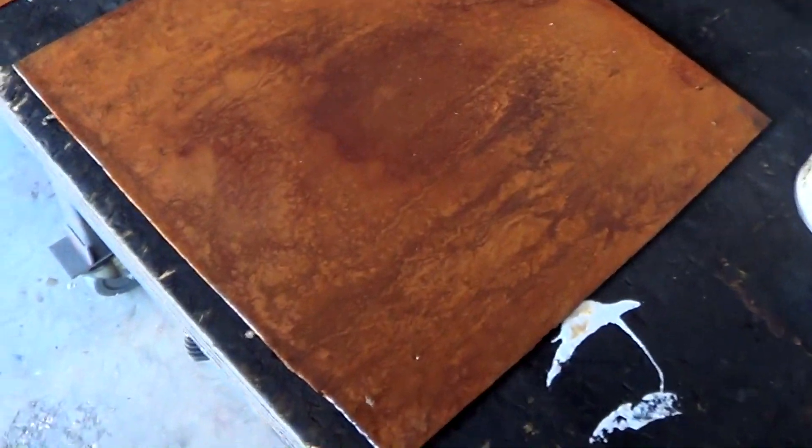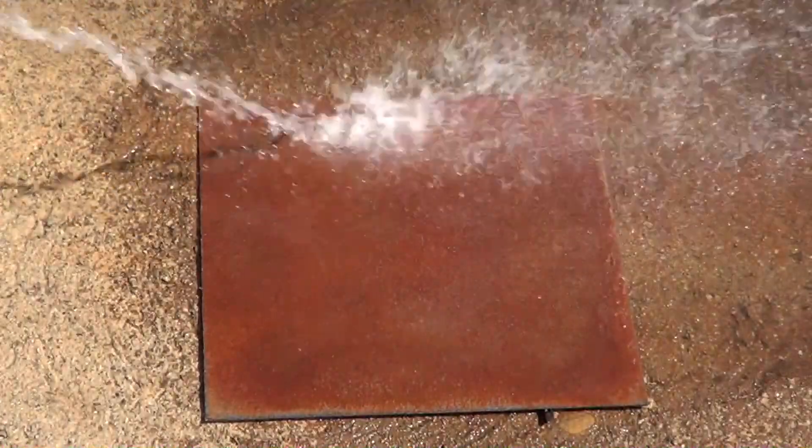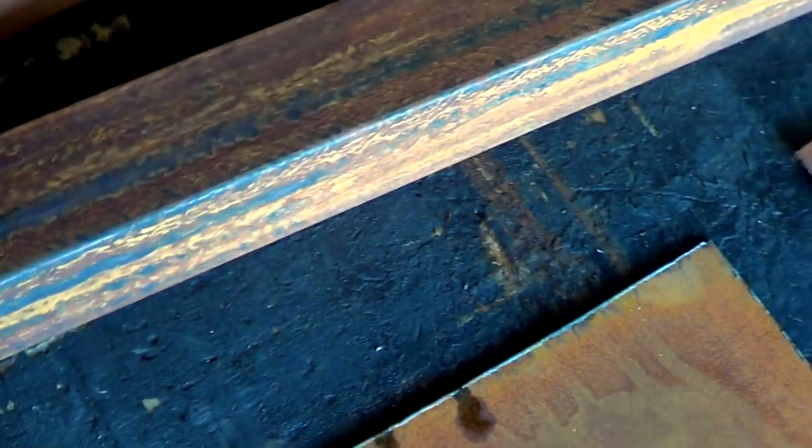All right, what did we learn? Let's take a look at what we've got. This is the piece I just pulled out — I did the time-lapse on it, roughly 15 minutes — we went from bare clean metal to this lovely patina. This is the cold rolled. I gave it another shot while this one was working, then hosed it off to show you the resilience. What it did was take the surface off, and interestingly this thing is still moist and it looks like it's darkened back up with rust. Even though that rusty bloom came off pretty quick and easy, just a little exposure to regular water rusted it back up pretty quick.